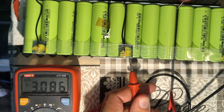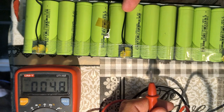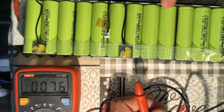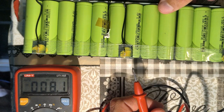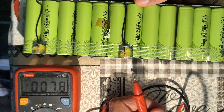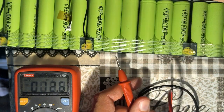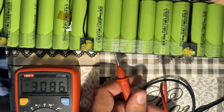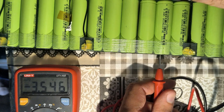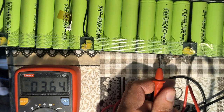From this we can identify that somewhere among these three batteries, at least one of them is also defective — at least one has a very low internal resistance, it's dying, and it's draining its neighbors in the process. Soon this is going to kill its neighbor because we cannot let the voltage drop much below 3 volts without incurring permanent damage to the cell. The next string is at 3.5, then 3.6 — that's still reasonable. And the last string is at 3.6 to 3.7. Okay.